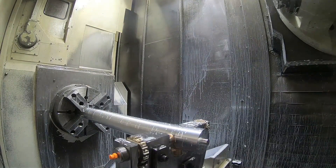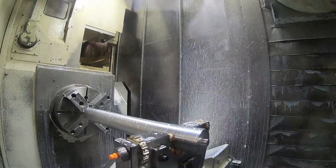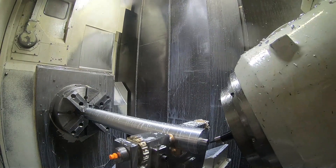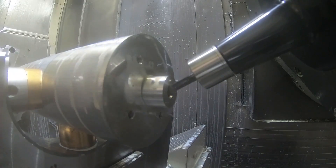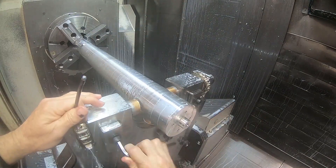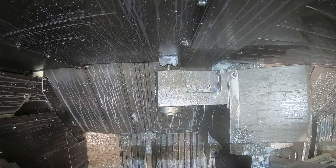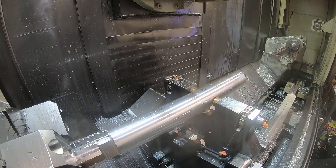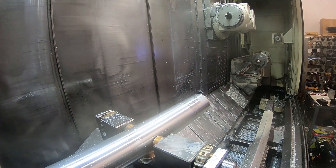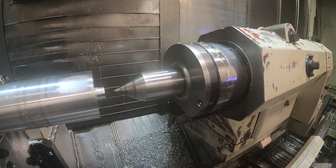I've got to put a center in here to hold this on the tailstock so I can do the rest of the milling on the fixture. I'm drilling a hole to start, then I'll mill a 30-degree angle with a 1.25-inch end mill. I like to do it this way because it more or less guarantees concentricity with the rotation. Here I'm showing the dogs that drag the steady rest - there's a hydraulic plunger that grabs the Z-axis, with two bosses, one for the steady rest and one for the tailstock on either side of the X-axis slideway. Then it clamps down to the ways and you extend the quill for the tailstock.